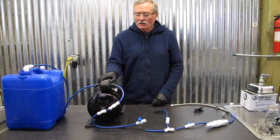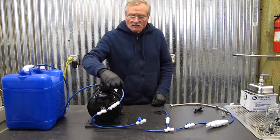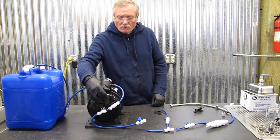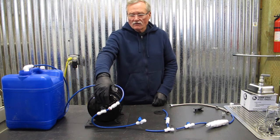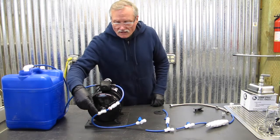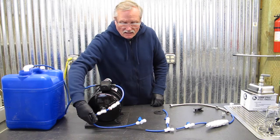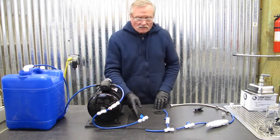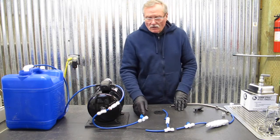From your water source, the water travels through the 3/8 inch John Guest tubing to the import of the water pump system. From the water pump, the water continues down through the check valve which is between the pump and the accumulator, keeping the pressure from the accumulator from being forced backwards. We leave the accumulator exiting out with a piece of 3/8 inch John Guest tubing.